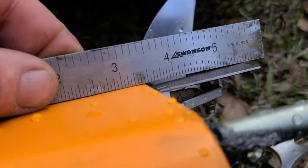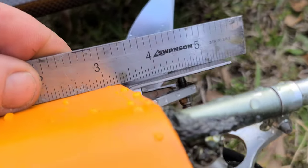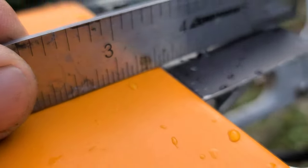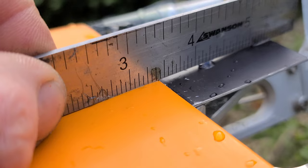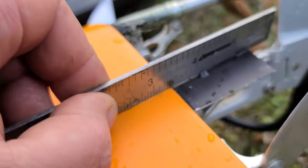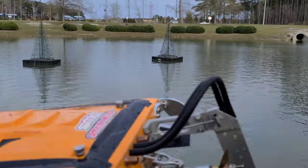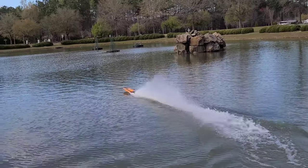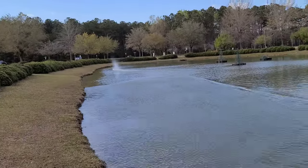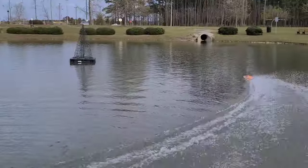This is the left side — it's upside down here. The left side is almost touching — it is touching the ruler. The right side has a little gap. So it's literally like a thousandth of an inch lower than the bottom of the boat — that should be good. Right trim tab is down a little bit more. Let's see if that helps the torque roll when I get on it hard. A little bit, but not much — probably need to go down a little bit more, but that's good for right now.